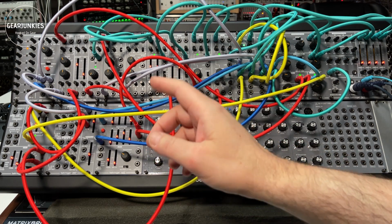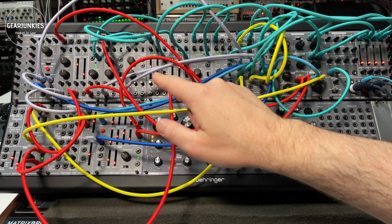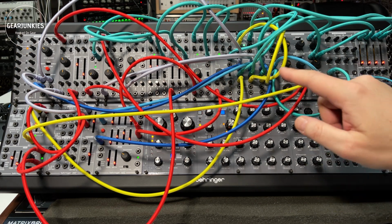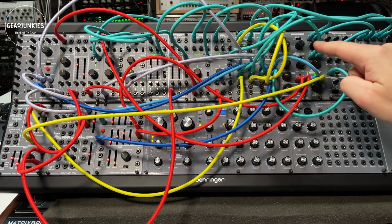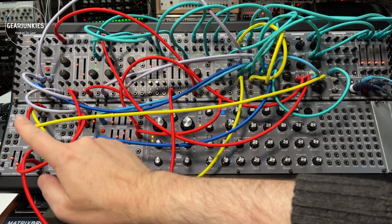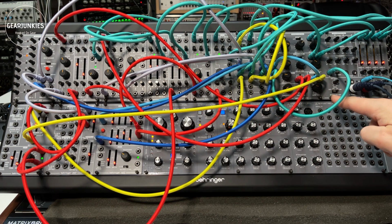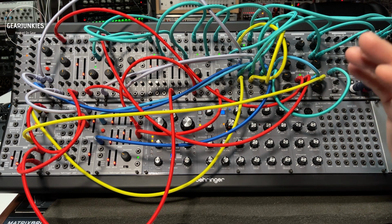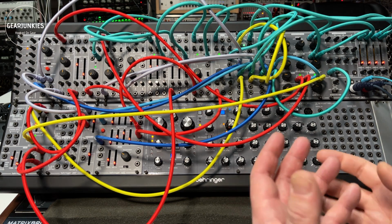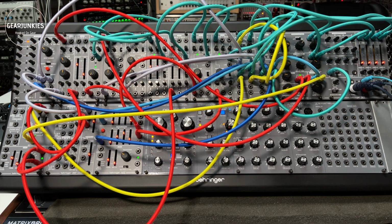In addition to the synth voice and the other new modules in the previous patch, I now patched in the dual VCO, dual VCF and dual VCA. And I ran their signals into the gate switch. And the gate switch is controlled through the sample and hold clock, which goes into the gate delay of the 172 module. And I panned the signals to channel 3 and 4 left and right to create some kind of stereo effect in addition to the running sequence from the synth voice.